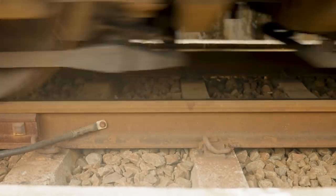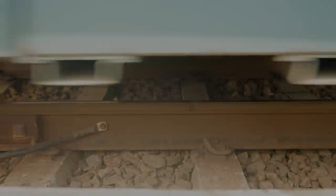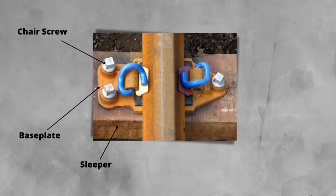They are all involved in securing the rail to the sleeper and keeping it there. The base plate is secured to the sleeper, normally with screws. A pad is laid on the base plate before the rail. The clips are then used to secure the rail in place — specifically how depends on their design. So now we know where these components can be found on track, let's look at them in a bit more detail.